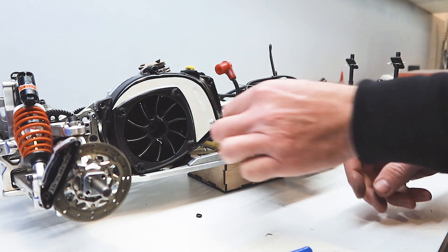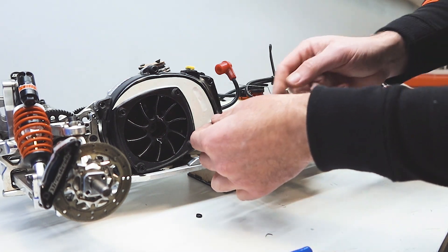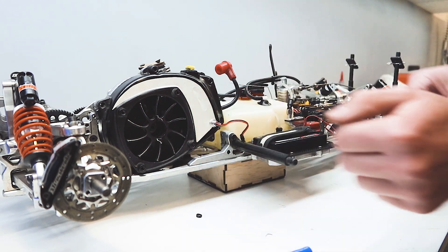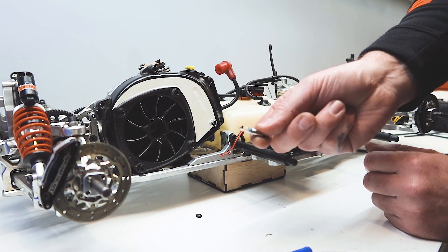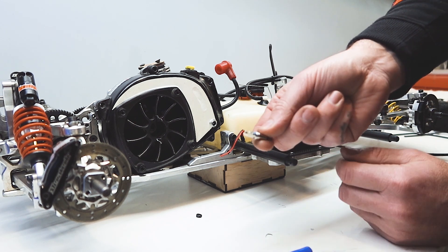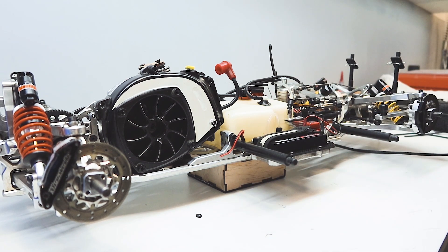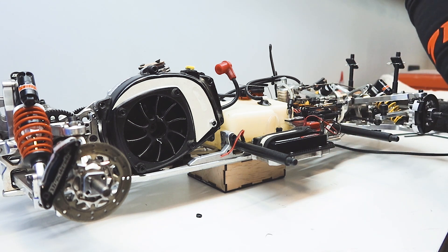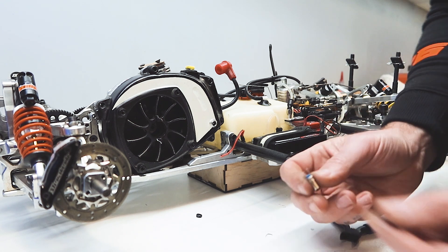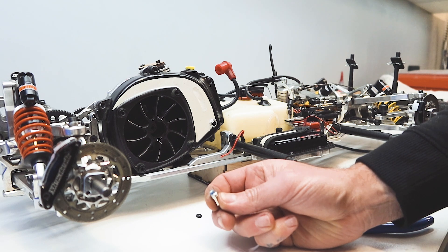So we're going to work on the plug now. The plug plugs into there. We'll just make sure this wire length is going to be fine - that looks good. What we need to do is trim that very end off - we don't want much of a contact left on there. I'll show you what I mean once I've trimmed it. I'll use the side cutters and just cut the ends off, so I'm left with two tabs there to solder to. That's all we need.